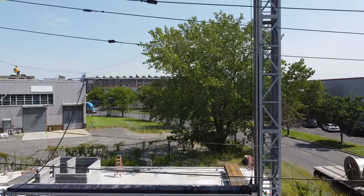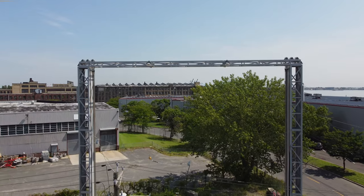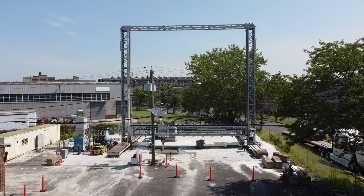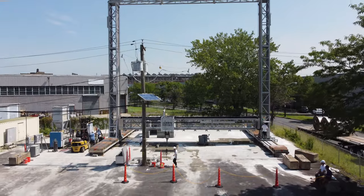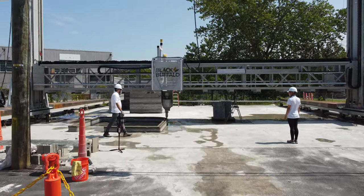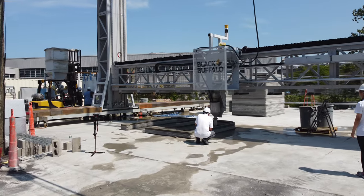There are also times in our printing protocol where we have to rest between layers. Because of the nature of the material, you're waiting — it's kind of like a bomb clock ticking down until the point where either the material at the pump freezes or solidifies just enough to basically go dead in the water. Anywhere along the hose or in the machine, we could get a clog, and for every second we're waiting it's a very careful balance — it's like a dance between the guy at the nozzle, the guy at the machine, and the crew at the pump. There's a whole host of things to take into consideration.